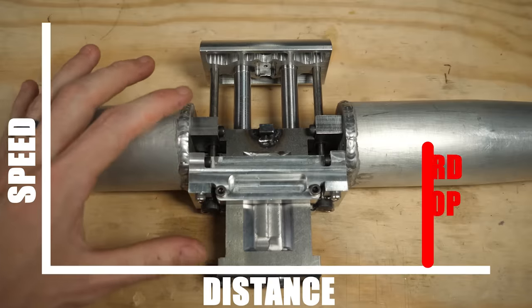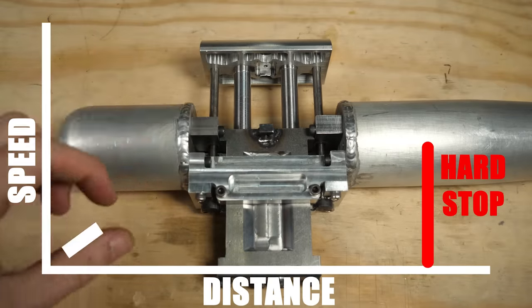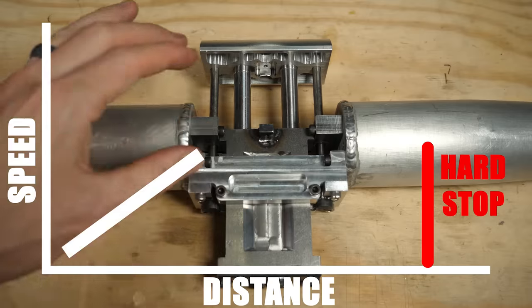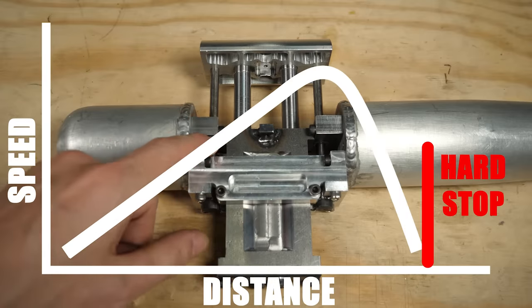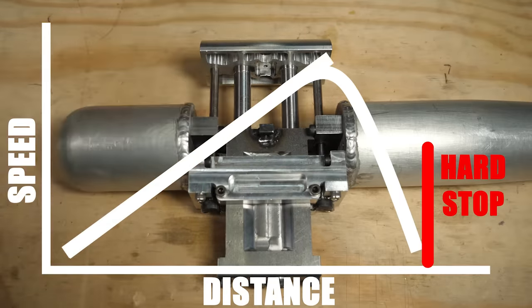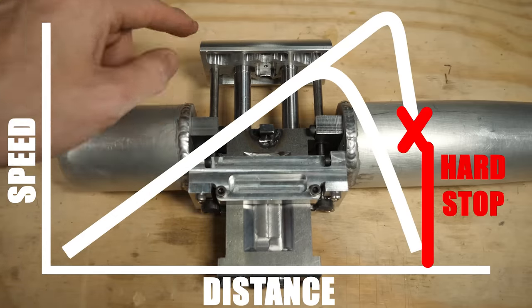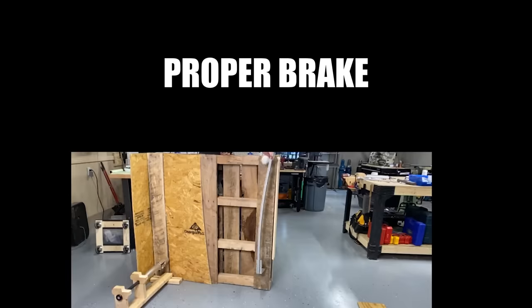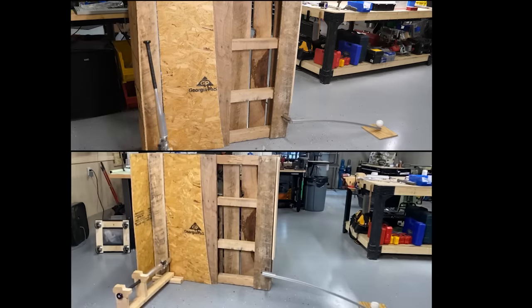Here's the knife edge that I'm walking. I need these pistons to accelerate for as long as possible. The longer they accelerate, the faster they go. As soon as they hit the springs, they start slowing down, and that sets the top speed. I want the springs to be as short as possible so I get the maximum travel before I begin braking. But if the springs are too short, then my deceleration will be very harsh, which will snap the stop rods. This is why the ball goes faster when the stop rods break. There's no springs to slow it down, so it gets to accelerate longer.